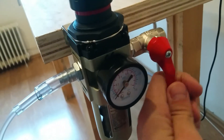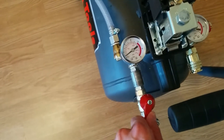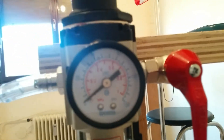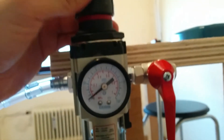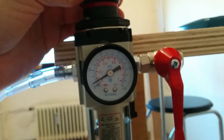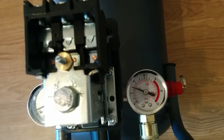It goes into the air filter over here, with another open-and-close valve on the output of the filter. Right now it's on zero, and if I open this valve up, we have something just under — let's say we wanted around half a bar, or about 10 psi. You can see it's holding up real nice, it's not leaking anywhere.